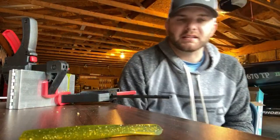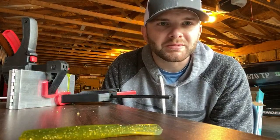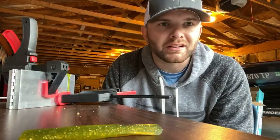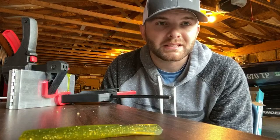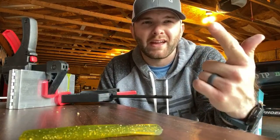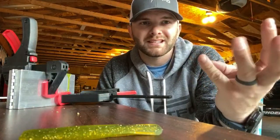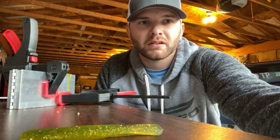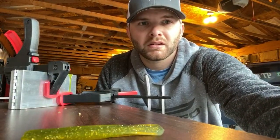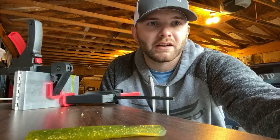I'll keep a bucket of the excess and remelt that later. I have a swim shad mold, an Erie darter mold, a crosstail mold, Midwest finesse, and a tube mold. The plastisol I already had heated to 350 before I added the colorant and the flake. But we'll add some other colorant — pumpkin seed and some motor oil — and it'll make it that mango color. I'm figuring out how to make the exact mango color.